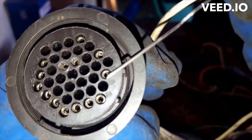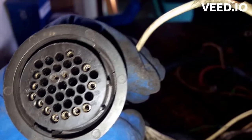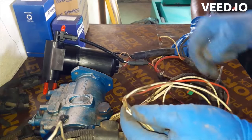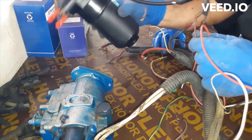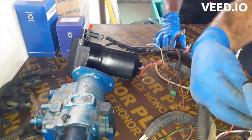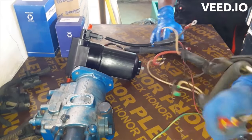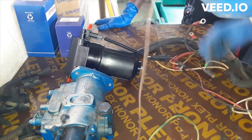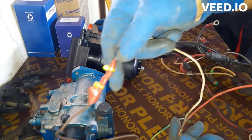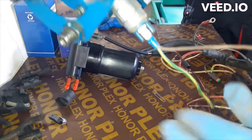Pin number 23 is the positive 12 volt and it is controlled by the FCR relay. It goes all the way and there is a splice where the fuel prime pump circuit and the injection pump solenoid circuit join — sometimes you will find corrosion at the splice where these wires are joined. There are so many wires; I'm trying to show you the target circuits — one goes to the fuel prime pump and the second goes to the fuel cut solenoid. From the splice to the solenoid there is another join, and this wire has so many joins — I will replace the whole circuit which energizes this solenoid.